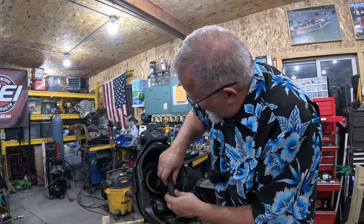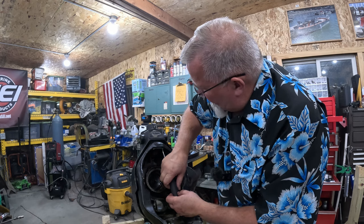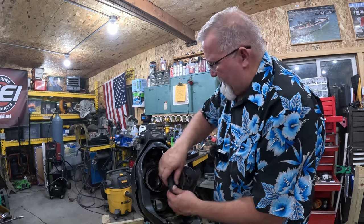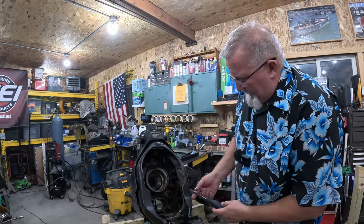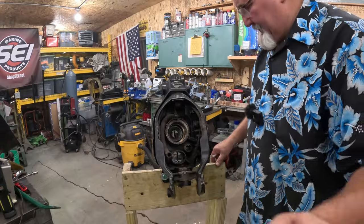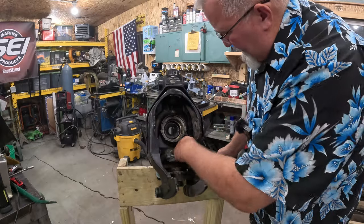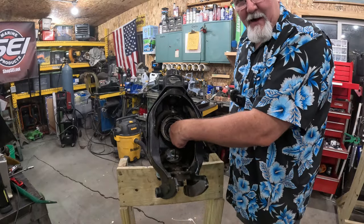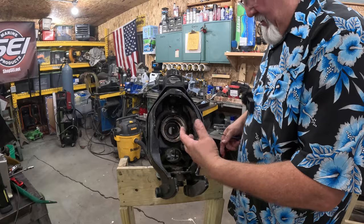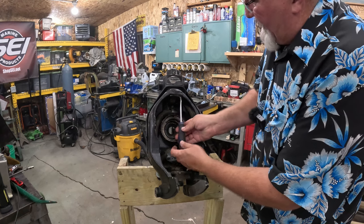What's this little shield here do? The other thing we're going to learn as we explore and take this thing apart is all the grease points that should be accessed on a regular basis. There's one right here in front of me, but I've noticed there's one on the side here that goes in this way. There's a grease zerk right here that goes in, and there's a channel that goes up to a hole inside the bearing area right here. That's why that bearing has that little flex piece around it — so you can pump grease up in here and lube the bearing.